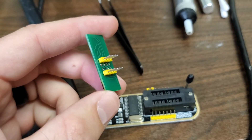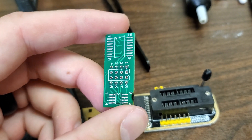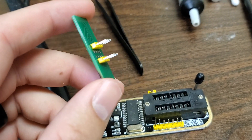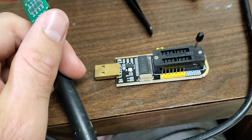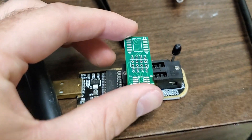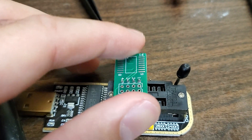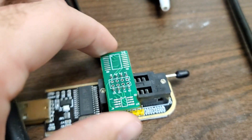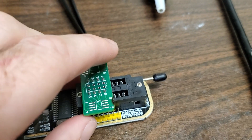It's going to come with these little pins. You're just going to want to solder each one of those in here onto positions 1 through 8 on the outside. That's all the preparation you need for this. Then when you go to plug it in, you're going to plug it into the bottom down here, and this is a little latch — you just clip it down and it holds that in there.